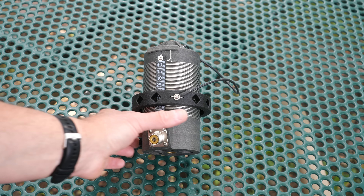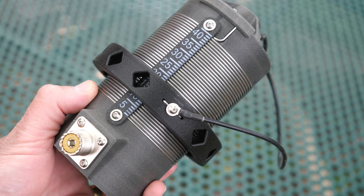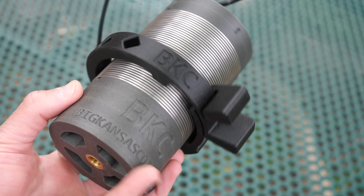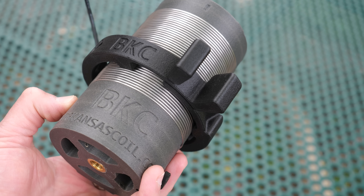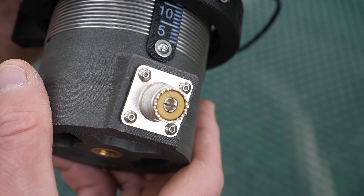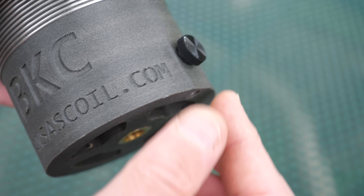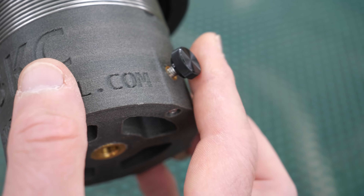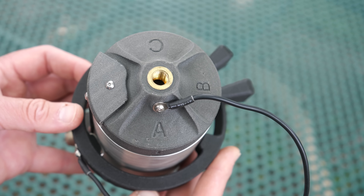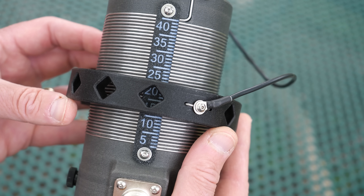The Big Kansas Coil is 3D printed out of a glass and carbon reinforced nylon material, so the coil is sturdy yet lightweight. The material is weather and heat resistant, so it is rated for up to 100 watts digital operation. The coil itself is approximately six and a half inches tall and three inches wide and weighs about 13 ounces. There is an Amphenol brand SO-239 UHF connector at the base and a thumb screw connection for a ground radial network. At the top of the coil is a 3/8 by 24 thread for an extendable whip. The center of the coil is wound with 14-gauge stainless steel wire and has a movable collar to adjust the level of inductance.